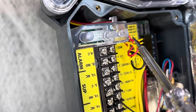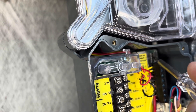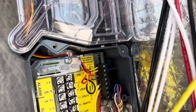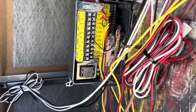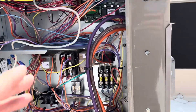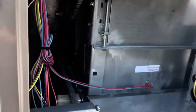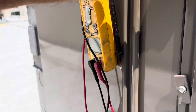We also want to come in here and turn this middle DIP switch from position 1 to position 2 to let this duct smoke know we have two sensors, not just one. I just turned the unit on. I'm going to make sure everything's set up right before I put the cover back on — I'll need some zip ties because I had to cut a bunch. We're in a delayed startup right now but we should be good. Just going to clean up while it's in its startup delay.